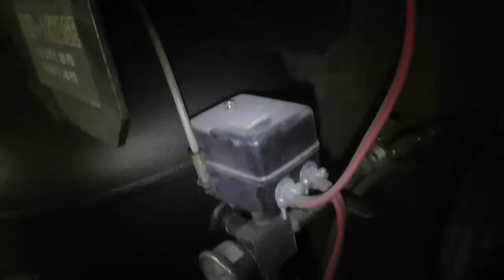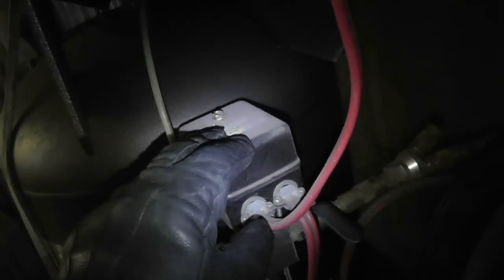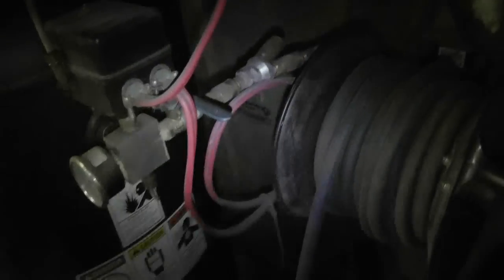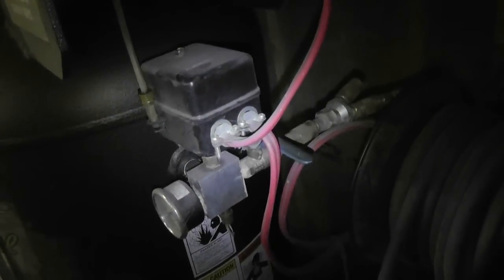Although I thought about it and said, well, first things first — 220 volts is what your typical compressor is, and any of these fans are going to be 120, so that's obviously not going to work directly. You could connect the hot leg of your plug to one leg of that and the other leg to your neutral. It wouldn't work quite so well for me because I never brought neutral to my control box for my air compressor, which is right here.